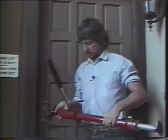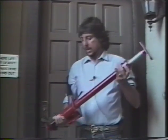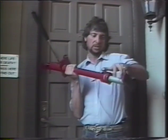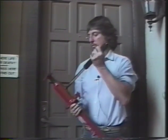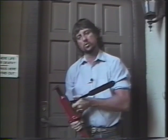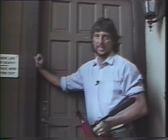This is manufactured by Omni Concepts in Vista, California. It's also sold by Schomer Tech, a number of other people. Same principle, it's a hydraulic jack. Easy to extend the legs all that distance, get it in tight on the jamb. Got a handle, folds up for storage, hydraulics on and off. This will put out about 4,000 pounds of pressure in order to spread the jamb. That is enough to spread most jambs without too much damage. It will not spread heavy metal jambs in large buildings.